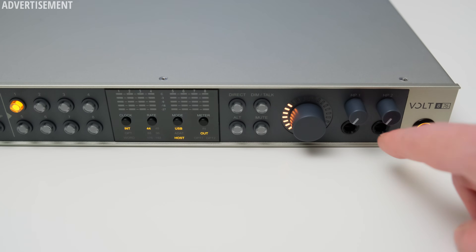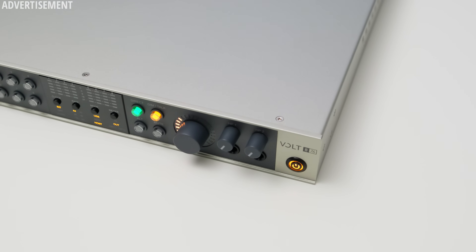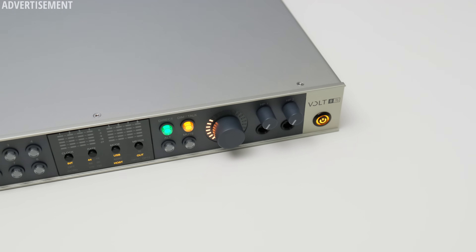One thing to note is that the volume dial only affects the main output and the alternative speaker outputs if set up. The other outputs bypass the volume control and always play back at full level directly from your DAW. On the far right you can find two headphone outputs with dedicated volume controls, and these outputs can also have independent mixes, which is great. However, Universal Audio has chosen to make the headphone output volume analog-control only. This means that even though you can control all features of the 876 via software — even the main output volume — the headphone volume is the only thing that cannot be controlled this way. Because the volume controls are so close together, I found adjusting the volume a bit annoying.